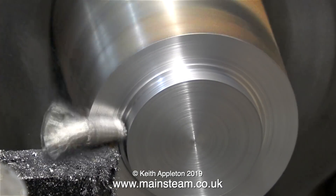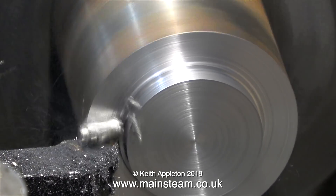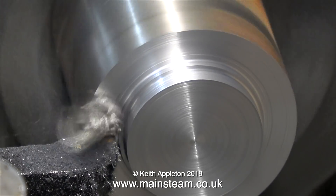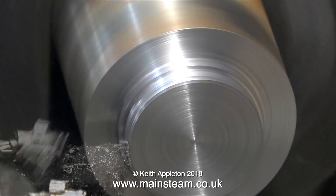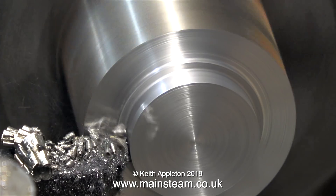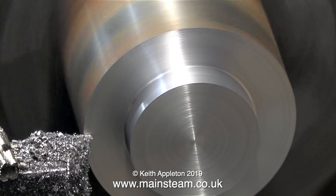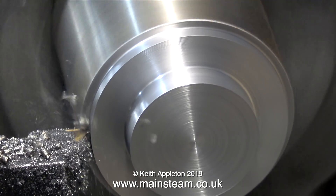By this time I'd replaced the top cover in the headstock because I don't want any swarf to get in there. As you can see, look at the depth of cut — there's no faking here, this is a very deep cut for a small light duty five-inch centre height lathe. As I've mentioned before, I really would like a bigger lathe, but the purpose of the tutorials is to show beginners how to do things. And this old Boxford lathe works quite well. I have to think outside the box sometimes as to the way I manufacture parts, especially the larger parts as they don't fit in the chuck very well. It's not helped by the fact that I don't have any outside jaws for this chuck, so I really think it's time that I bought a larger chuck for this Boxford lathe.